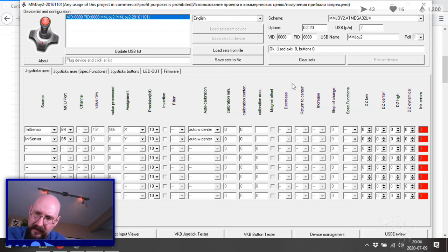But I think, friends, if I can say, we have mostly, successfully, done a thing. I mean, if it's a bad wire, let's check our continuity. Let's see if that's the case, because that's an easy one. Yellow to yellow. That seems. Huh. Yellow to yellow. That seems pretty good. Okay. Orange to orange, are you okay? Let's unplug that so that we don't have voltage going through it here.